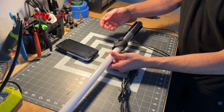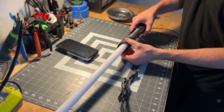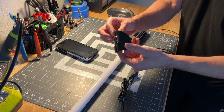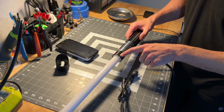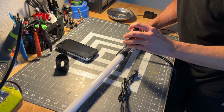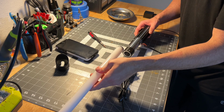All right, so we'll move on now to the blade. For your blade to come in and out, you have a thumb screw here. That thumb screw holds the shroud on. So you just loosen the thumb screw and the shroud comes off. Take it off over the top of your blade. Now this is a very nice high quality shroud. It's metal, okay? And then that reveals right here a set screw, or blade retention screw. You'll be given an Allen wrench so you can get that out. Basically you just loosen up that retention screw, and then you can take your blade out.